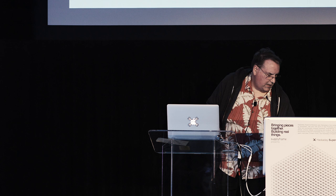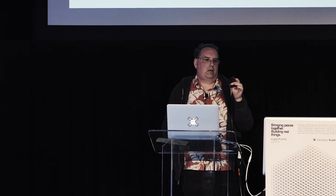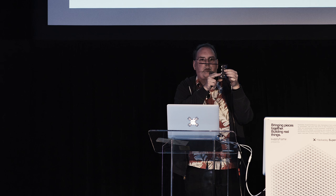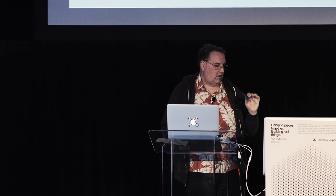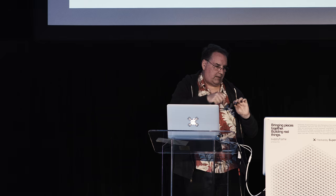So I have examples of other things. Oh, so here's another one. If you're going to do tab routing, make sure that if you have parts that overhang the edge of the board, don't put a tab under them. This was a big sore spot for the USB micro ISP. So you can come up and see the example of where that went wrong. Fortunately, in this case, the assembler was able to work around it. Otherwise, he probably would have had to break all those tabs off, and that would have added to his cost, which I'm sure he would have transferred.